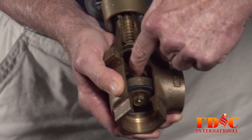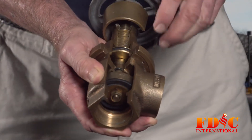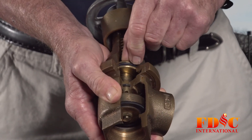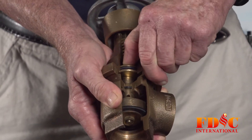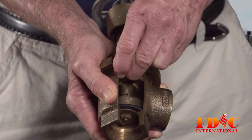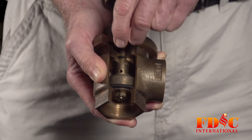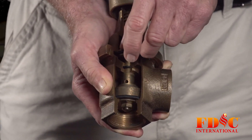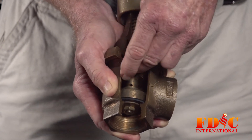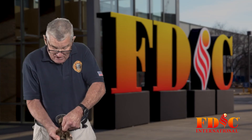When the flow is stopped from the sprinkler head, pressure is transmitted back on the downstream side through the waterway into this chamber, which exerts a downward thrust on the valve. There are field adjustable valves that actually have a spring that assists in opening the plunger, and depending upon the make and model, firefighters may be able to adjust that spring. The spring actually assists in opening the valve.